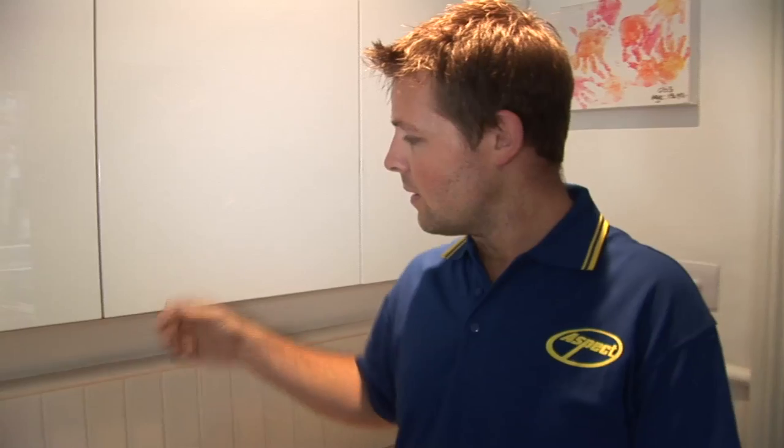What you need to remember first of all if you're painting onto shiny surfaces like this is it's going to need what's called a melamine primer — something that basically prepares the surface to be over-painted first. Because if you try to paint on this with a normal oil-based undercoat, gloss, or eggshell, it's not going to stick — it's going to peel straight back. Once you've put a melamine primer on, we usually take two coats, leave it to dry, then put your undercoat on.